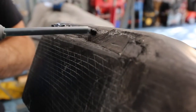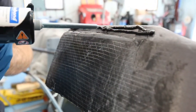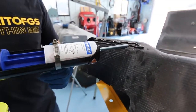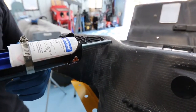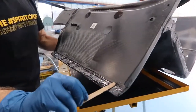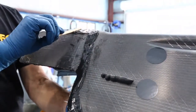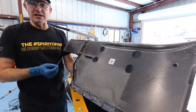The idea is to lay down a nice bead of epoxy, then smooth it out with a clean, fresh popsicle stick. What we don't want are any air pockets — we want enough on here that we've got maybe a 16th to a 32nd of an inch layer after we smooth it all out. Once we put it together and clamp it down, we want a little bit to squish out of the edges so we're sure we've got nice, even application inside. I've spread out the beads with my popsicle stick — no air holes or thin spots, as those would create a void and a weak spot. The ET5429 can handle a gap up to 0.2 inches, and I want enough that with just a light clamp I get some squeeze-out on the sides.